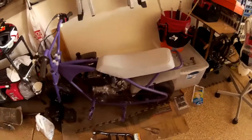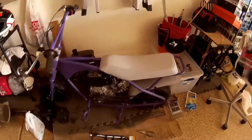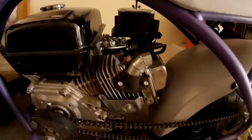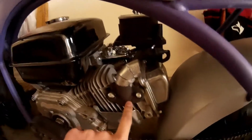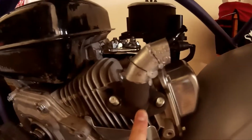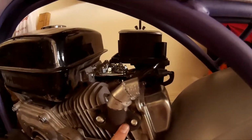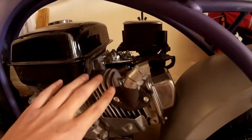So once you have your desired pieces cut out for whatever exhaust design you're making, you're going to want to mock them up to see where it's going to be going. So right here on mine, as you can see, I've got mine hot glued to my flange pipe piece. I got all my angles cut out. They're looking beautiful so far. So I just got them mocked up like this with hot glue so that when I weld these up, they're already in place.